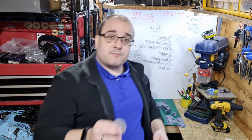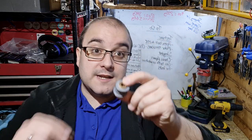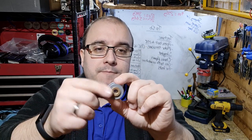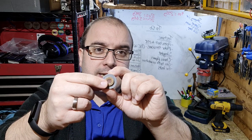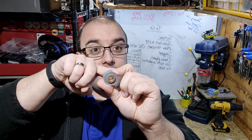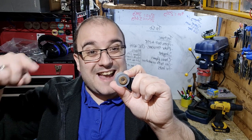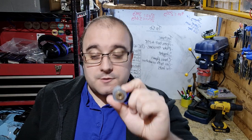And then the last pieces are prototyped bits for the saw mechanism. So this is the intermediate stage pulley. I've got an aluminium one of these coming, but I wanted to be able to prototype it and try and get a mechanism going. In the middle of this, I pressed in a little oil-lite bushing so that I'm not running the 3D printed stuff on the weapon shaft. And this goes from the weapon motor to this one. And then the belt will have a second stage running off this pulley onto the one at the end of the arm where the saw is going to rotate.